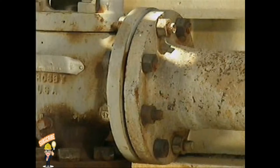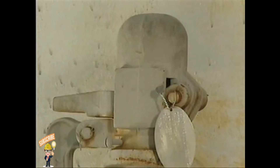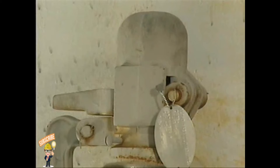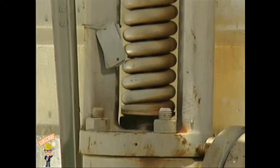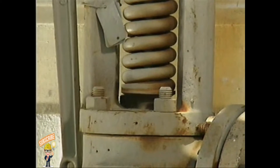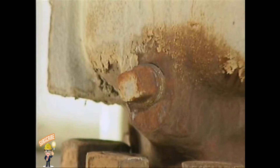Check for signs of leakage or leak-through at the discharge piping bolts and possibly around the yoke or bonnet bolts. Some valves have a yoke and a bonnet that are two connected pieces; others have a single piece that may be called either a yoke or a bonnet — for consistency, we'll use the term yoke. Also inspect the top or cap of the valve. Next, look for steam or warm condensate leakage around the drain plug and around the bolts on the yoke.